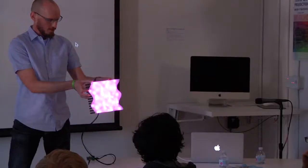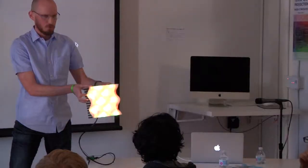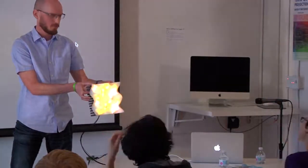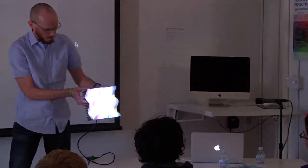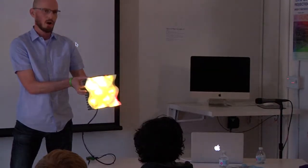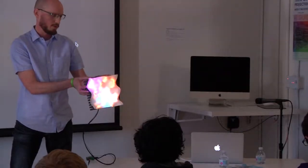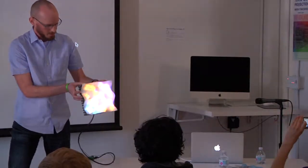It is two pieces that were 3D printed. The front piece is a natural PLA, which is kind of a semi-clear white, and then I sprayed it with two coats of spray frost on the front and back. It's all designed custom. The LED strips have a density of 60 LEDs per meter. They are RGBW — I think it's a neutral light. I like the RGBW for illumination purposes. It's more comfortable to look at — it's a broader spectrum light.